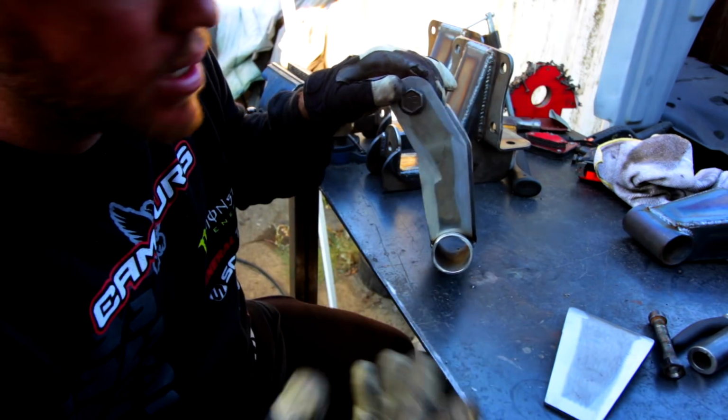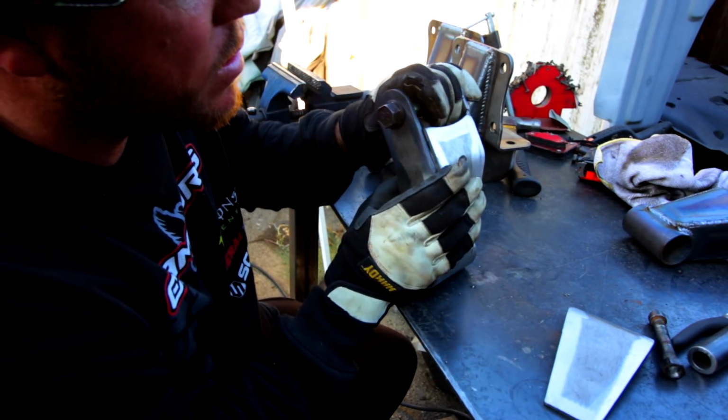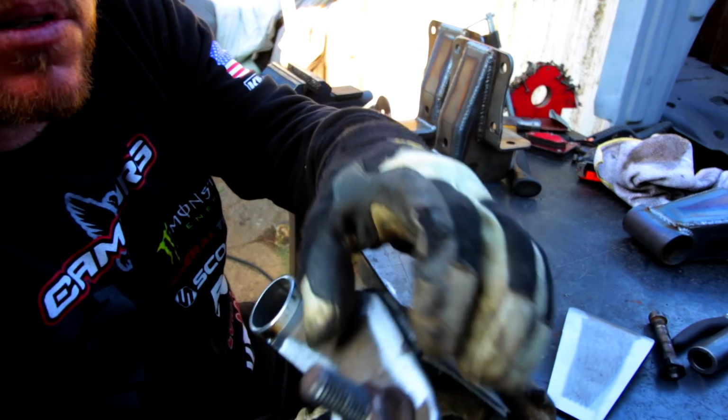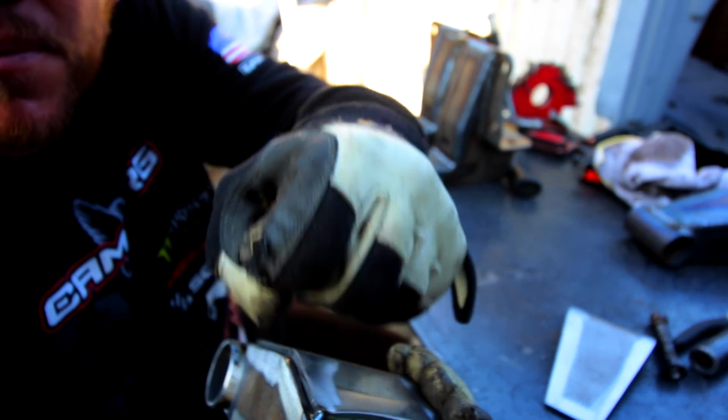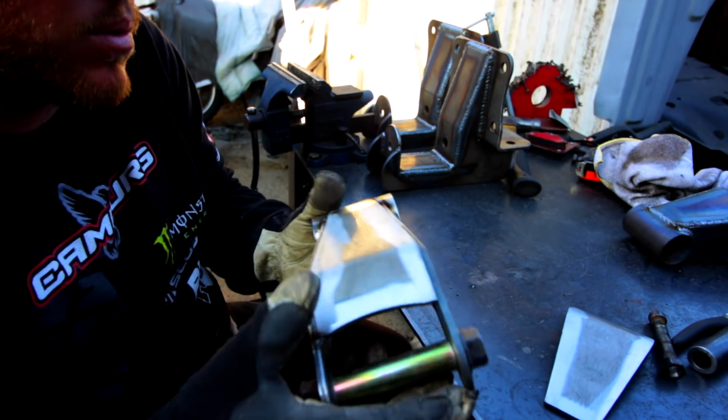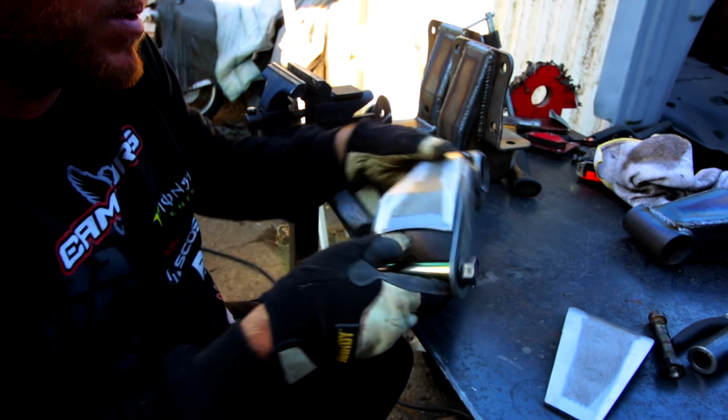So as you weld and do tack welds and whatnot, the metal moves a little bit because that weld itself starts to cool down and it pulls itself in. So you want to go back and adjust. Don't think just because you tacked it, it's in the perfect spot.